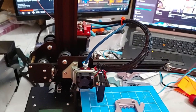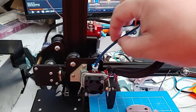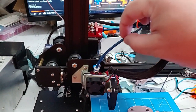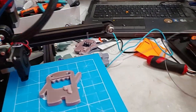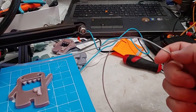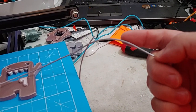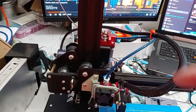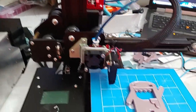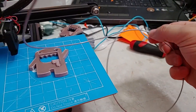Capricorn tubing — I actually had my first victim of Capricorn tubing. One of the problems you can have with Capricorn is if your filament is not within spec. The tolerance of the hole inside the Capricorn is much tighter, which reduces slop, but if your filament is oversized — you can actually see how the filament gets bigger right here — yeah, it jammed inside the tube. Almost made it to the hot end, but that's a bit oversized right there.